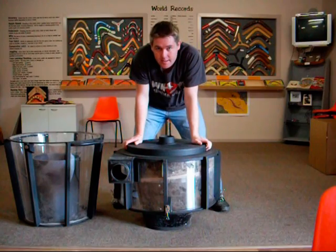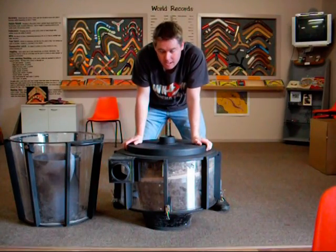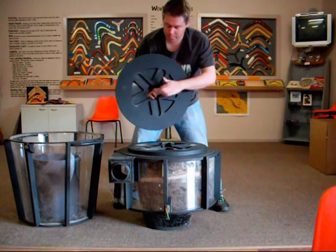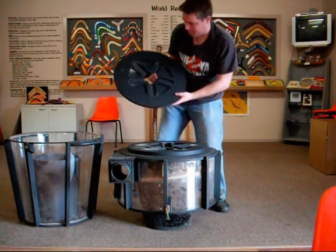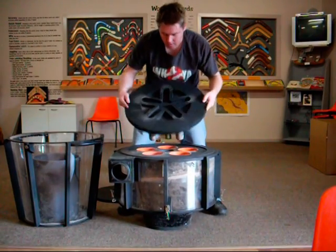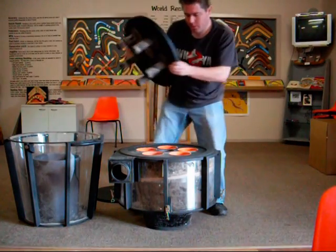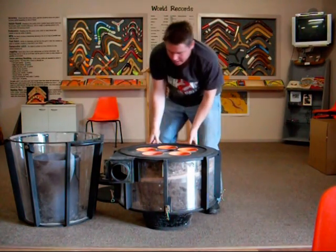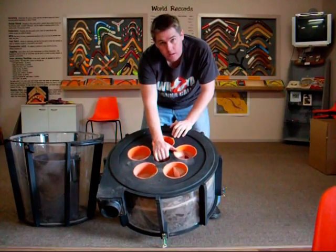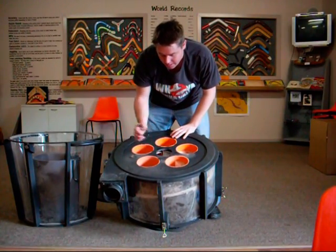To make life a bit easier, you want a way to get into the cyclones in case a blockage ever occurs, so I've made a two-piece lid. We've got the upper piece with all the channels from the five cyclones on the inside, and then the lower piece with five channels going to pipes that go down into the centre of the cyclones. Once you pull this out, it allows you to get into the inner cyclones and clear out any blockages with your hand. There's also a hole in the middle so you can access and clear the inlet pipes to those five cyclones.